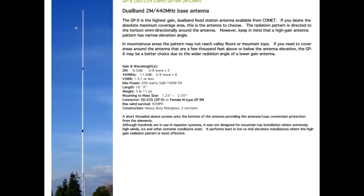The anecdotal reviews I read indicated that the ABS joints utilized by Comet are less likely to allow for the ingress of water. Speaking of water ingress, I discovered while looking into these tall verticals that there are two major potential problem areas that develop over time: the first is water getting into the places where the vertical sections connect, and the second is cold solder joints at the base of the antenna. Most concerning to me is the cold solder joint issue.